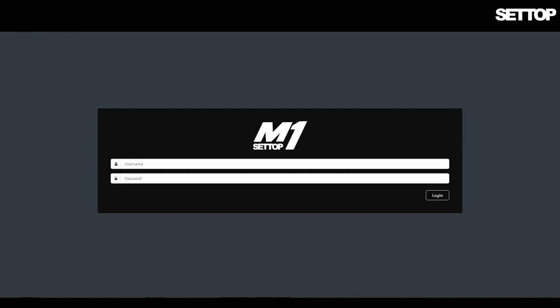In this tutorial, you're going to learn how to configure the replacement of a total station in the monitoring system and how to carry out the reorientation of the newly connected station. First, you connect to the Settop M1 device via istconnect.com using the access details that you have registered previously.